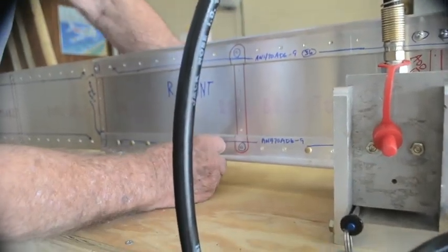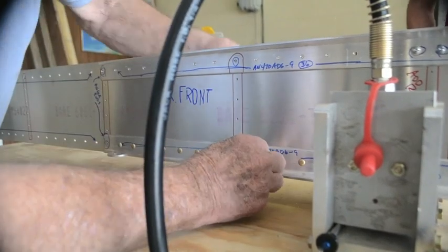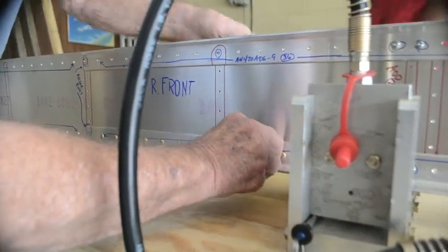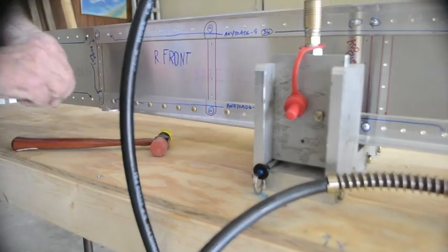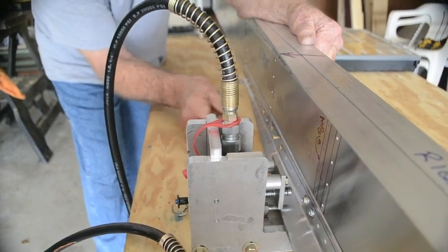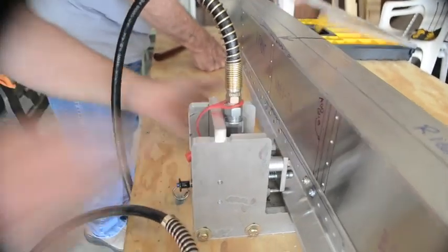Paul's over there doing it now but this is really great. Also leaving the eighth-inch cleco holes is where they go, so you don't rivet those now. Those spars look really, really, really nice. Thank you, very very nice. If you squeeze them when they're not tight against it, it makes bad things happen, so always make sure they're tight in there. Always flat against the head because it won't push it tighter for you. I always go in here and kind of pull back against it when I do it.